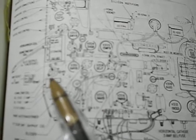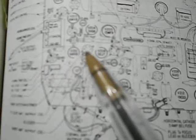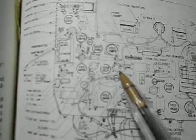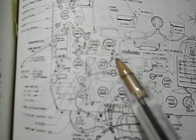Again, here are those two big fat tubes. There's that coil that could easily be seen. Here's a tube, there's a coil, here's a tube. That's the 3EJ7. And here is the coil that I believe needs to be adjusted to bring that tint range into play. I'm going to post this and hope this helps.